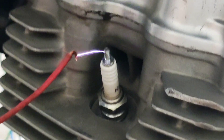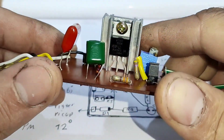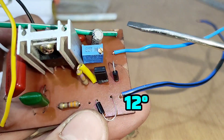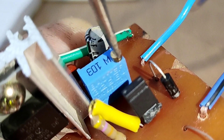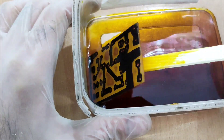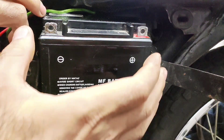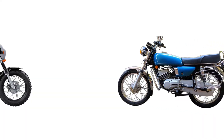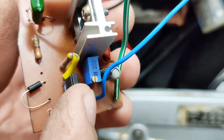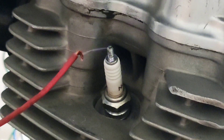Welcome back to our channel. I'm Chris, and as promised, this video is a step-by-step tutorial on making an adjustable CDI. This CDI has two separate outputs for trigger 12 degrees and 36 degrees, which can be adjusted by the R3 resistor. Other features: it's easy to make, can be installed on two-trigger and one-trigger motorcycles, works without a battery, and supports two-stroke and four-stroke engines.